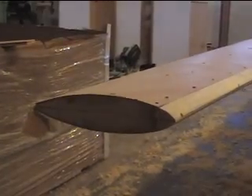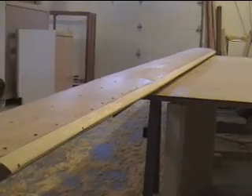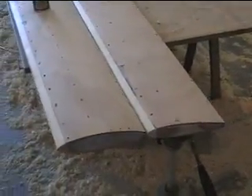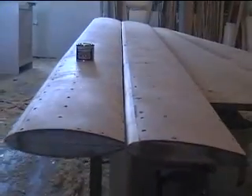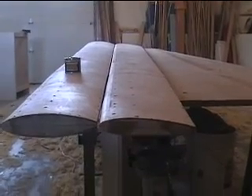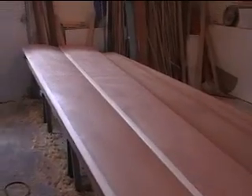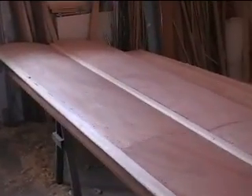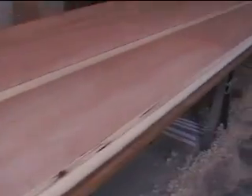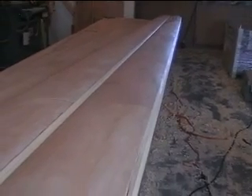I've got the nose of the flap completely done as far as hand planing — all I have to do is come back and block sand it now. That took about three and a half hours to get it to this point. I've got both the main wing and the flap noses shaped now, and it took about six hours to do both together. I also had to straighten the trailing edge and ended up cutting a little more off than I wanted, but you have to have it straight. Overall I'm really happy with the way things turned out. It's a meticulous job, but it's actually one of the most fun parts for me. It's a bit of a craft, and the more you take your time the better you'll do — you can't be in a hurry when you go to shape.